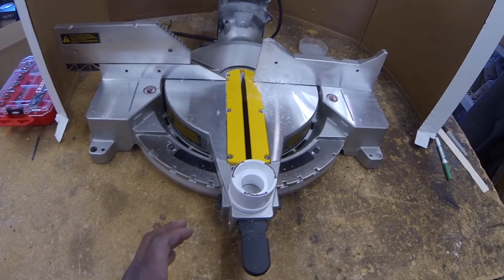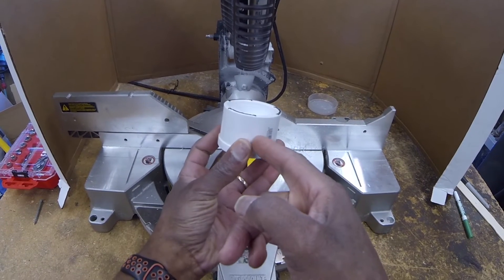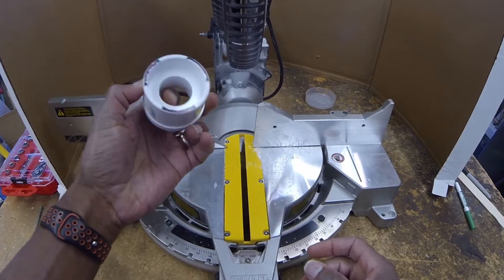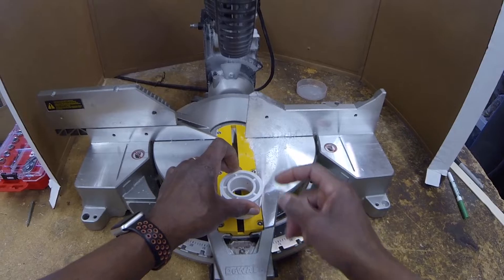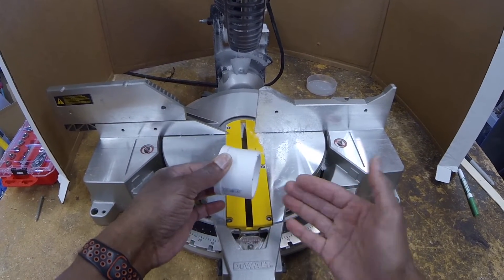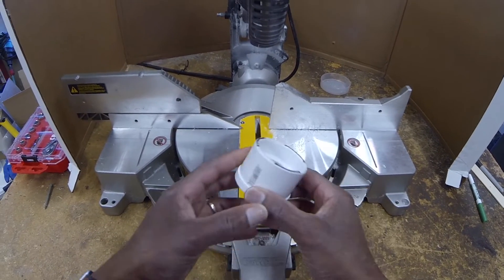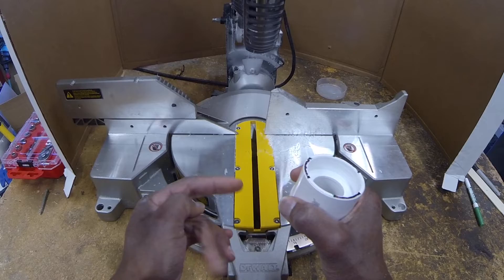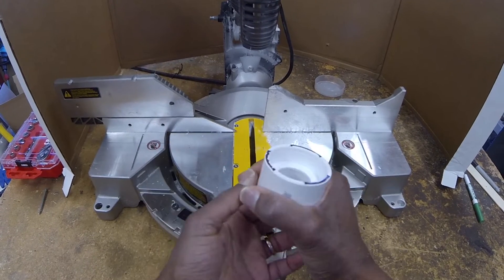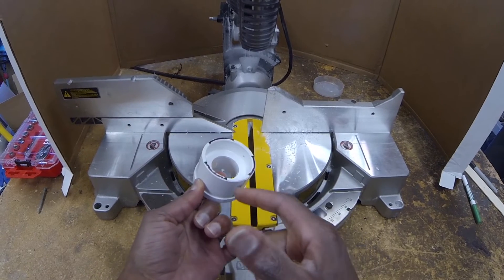For the solids lifting outlet, we're going to need to have a piece on the bottom of the tank that has some spaces in it to allow material to move in and go up into the lifting pipe, but is a little bit wider so we don't create literally too much suction on the bottom. So we're going to use this bushing and we're just going to notch this.